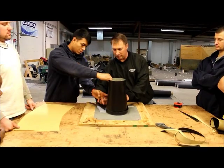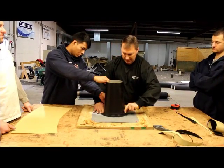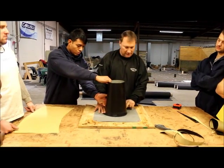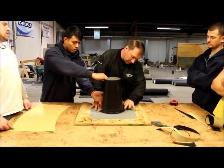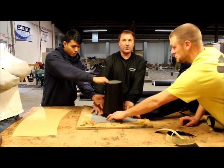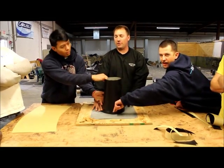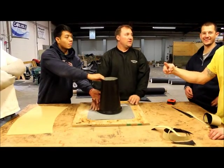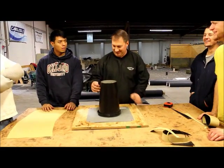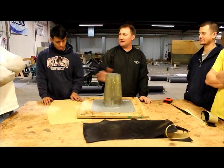Okay, again you're going to do it the same way as you do the pipe. You're going to bring this down about four to five inches there, and then you're going to prime it and this is going to wrap around the same way. Real easy — go ahead and help, just push that down here. It works better when it's all primed and down. That's your wrap right there and it wraps around real nice and easy. So you could almost get your measurements and just cut a boomerang type — it'd be close. That's the banana. Makes it nice and easy to wrap a pipe like that. The other way is stretching the hell out of it to try to keep it going straight, because you can't just wrap it like a normal pipe — it'll be open at the top, bigger at the bottom.